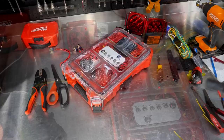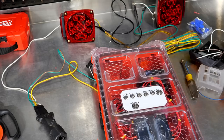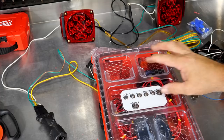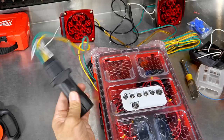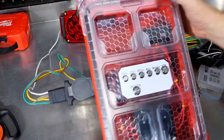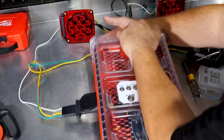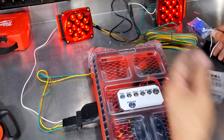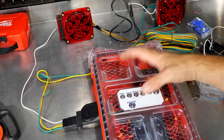Just so we don't have to go outside and actually hook it up to a trailer, I've got some trailer lights hooked up here. We have it wired up correctly, other than our jumper wire jumping from the white ground wire to everything. We've got tail lights, stop lights, and turn signals, and then we've got our four-way plug plugged into our seven-to-four-way adapter — we'll go ahead and push that in, it locks into place. Got our self-contained Packout trailer tester. We'll turn our power on — tail lights should give us both lights. There we go — running lights. I didn't hook up these running lights, but they would tie into that same circuit and come on with those tail lights.